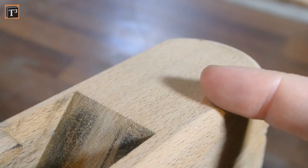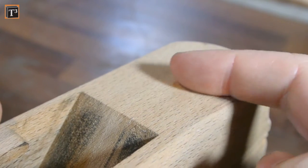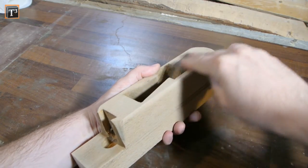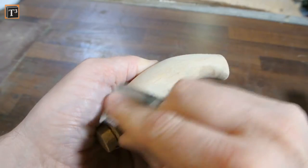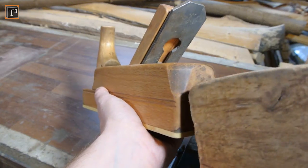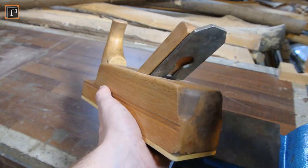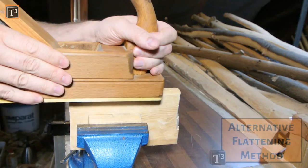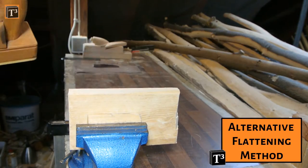After the wood has dried you will notice that the surface is now rough from loose fiber ends that stand up. This is actually a good thing because when you now sand them off with 400 grit the wood will be absolutely slick. I use another plane to flatten the sole — if you don't have a plane yet, that's a catch-22, so you can watch my jack plane restoration video for an alternative method.